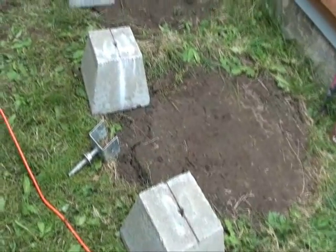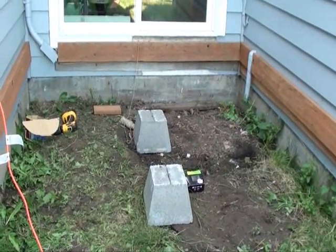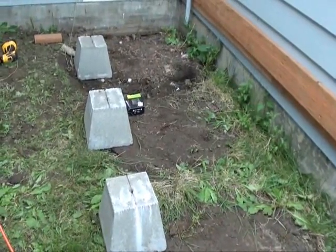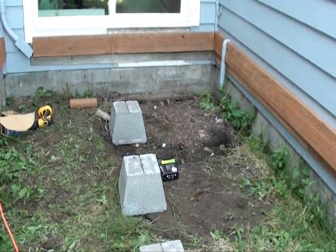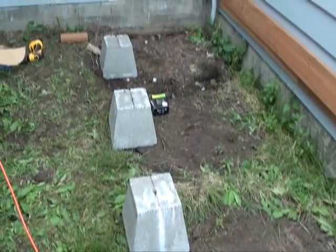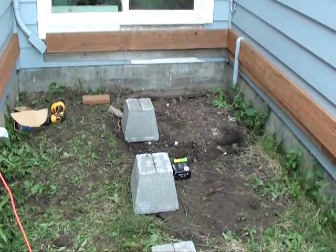Anyway, we found out that our piers here are not tall enough to do what we're doing, so I sent someone to the getting place to get me some stepping stone type deals to put underneath it. What I figured I would do is set this center run, oh, I don't know, 1/4 to a 1/2 inch taller than the two outsides, and then in time, if these things settle down in, it'll probably end up pretty much flat.